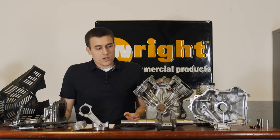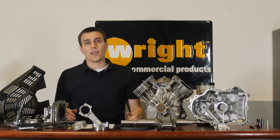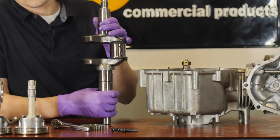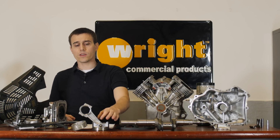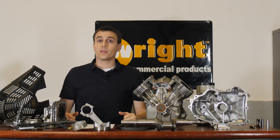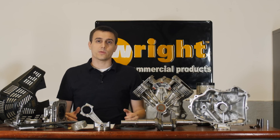On the mechanical end of this engine, where the moving parts are, we have a flywheel that's dynamically balanced. We have a crankshaft that's balanced on two planes, and the crankshaft itself has been forged. It's not that common, but when you forge a crankshaft, you get a stiffer, stronger crankshaft, and that's all going to help with vibration and mass. We also have a connecting rod that's forged rather than cast, and with a forged connecting rod you're going to have a very consistent weight and the engine will be better balanced. Between those different factors, you're going to have an engine that runs really quietly and really smoothly, and that also helps with the life of the engine.